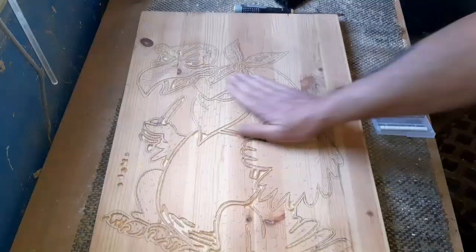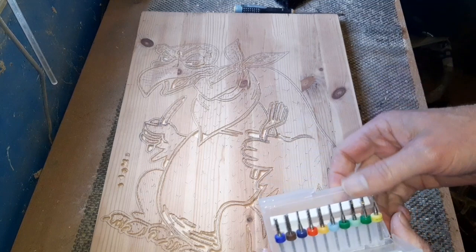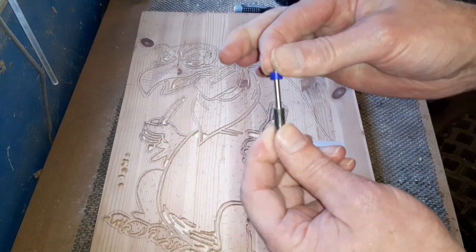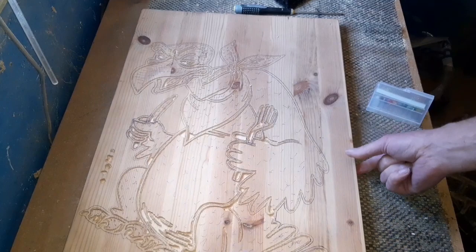You can see from that everything's nicely done with those CNC bits. It's just a simple case of popping an end milling bit on — get a nice size one. We'll remove the CNC bit — that was a new bit by the way — and slot the end milling bit in. We'll set it to the same depth, three millimeters. I've removed a fair bit of sections here so we'll use it as our little depth gauge, then start removing all these areas.